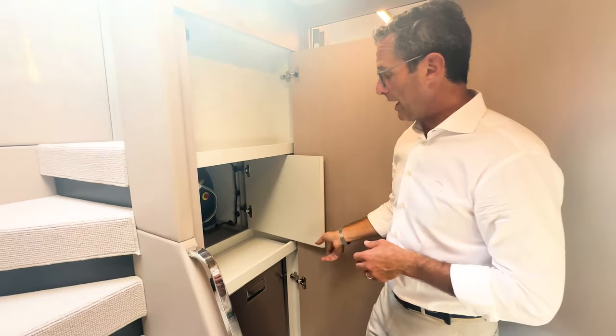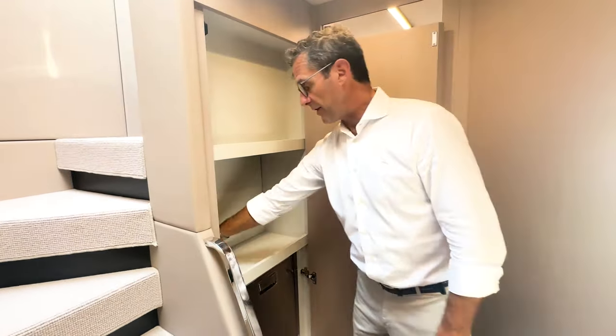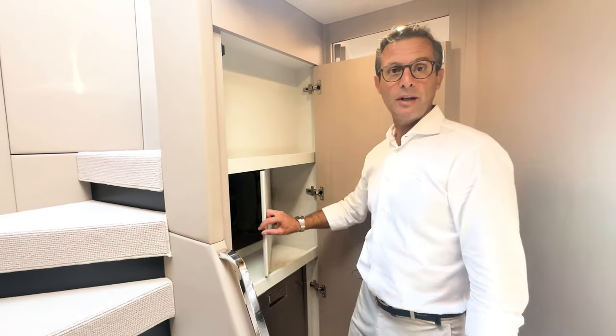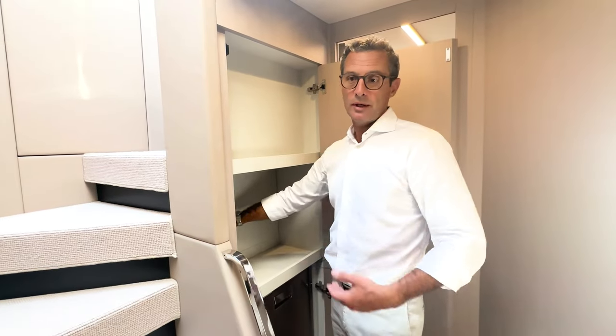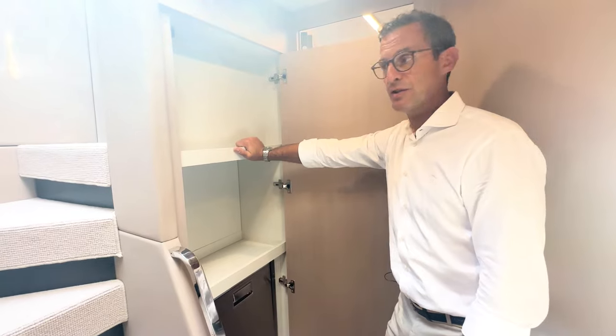And look how easy and convenient that would be on this boat. You remove probably three towels and two glasses, open this, use a screwdriver, and you replace your heating element and you're done. If you have a spare on board, then your vacation will be safe. In 10, 15 minutes, you're gonna take another hot shower.